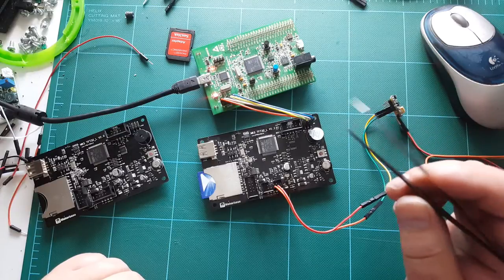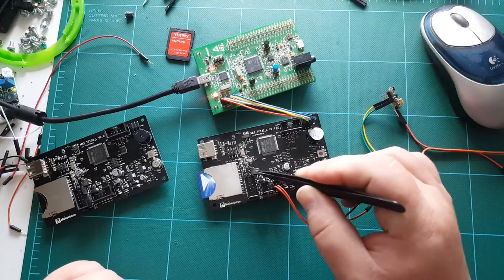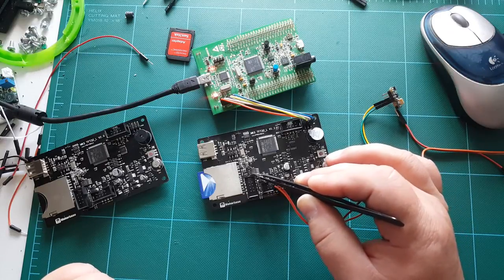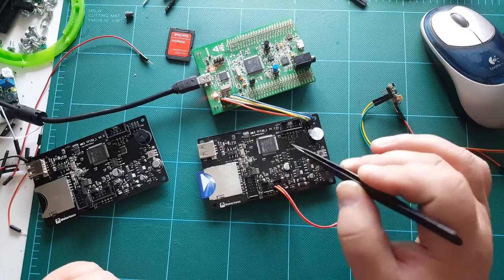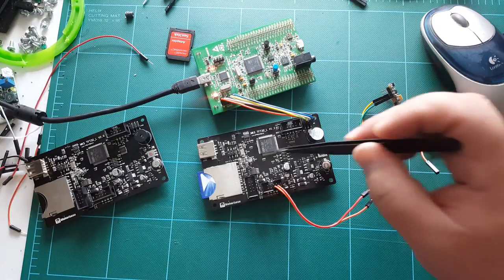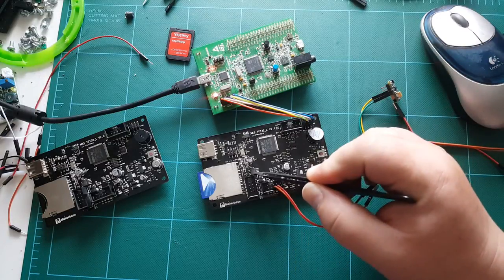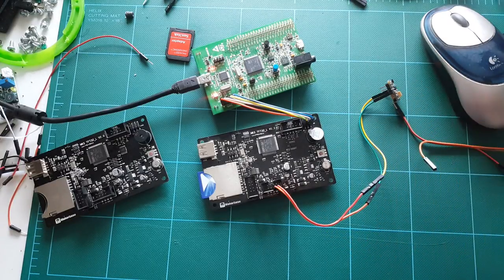So I'm guessing it may be this external flash memory chip on the board. Maybe something went funky with this chip. I could probably try to tap into this chip - read it from the good board and write it to this one - but that would be tricky. I might have to remove it off the PCB, because if I apply power, it goes to the entire board. I could try to lift the power supply pin off the PCB and apply power just to this chip, but I don't want to risk ruining a good board using it as a donor.